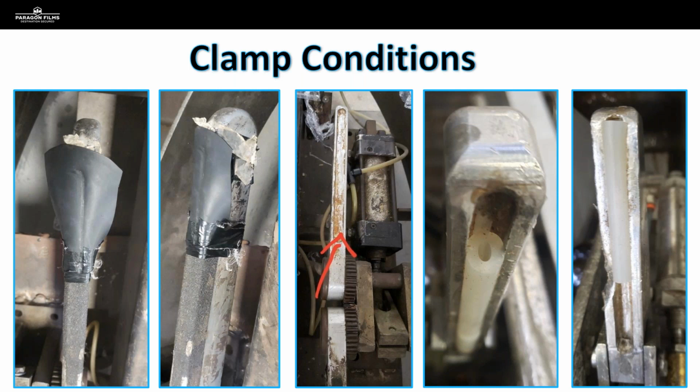So we just need to be watching for what's going on with the clamping system, what kind of shape that clamp itself is in. And this is really going to be one of those situations where if it's not as simple as replacing the actual surface inside of the clamp itself, if it really is a timing issue, this is a great opportunity for us to identify it and bring it to our customers and say, this is something that our service techs could get fixed for you and solve this problem by addressing the timing issue on your equipment.